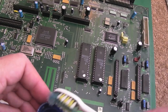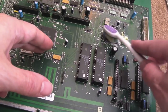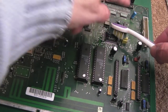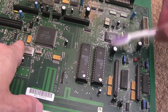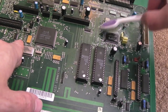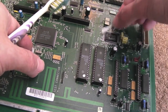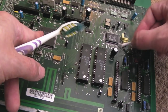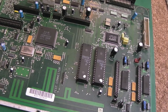I've had an inspection - there are a few little marks of corrosion on the underside, but nothing major. I'm now going to clean up with a toothbrush and some IPA. I don't need to use vinegar - there's literally no corrosion except a bit up here. I'm using the toothbrush to get in between the pins - there could be a flake of corrosion that's landed under something. I'll do the same thing around the main processor - it's not really just a processor, it's a system on a chip: the ARM 250. I'll give a clean around the RAM down here too as it had a little bit of corrosion on the edge of the pins.